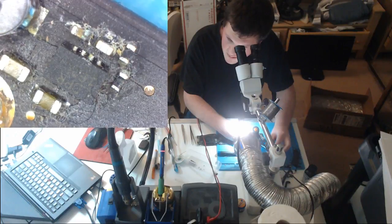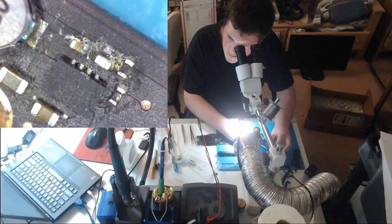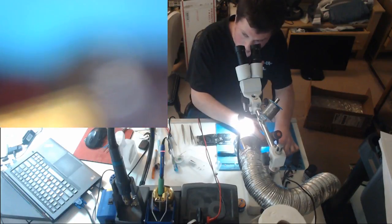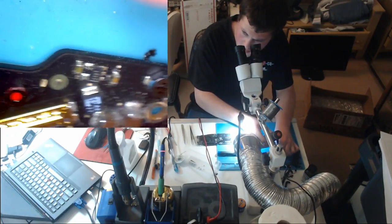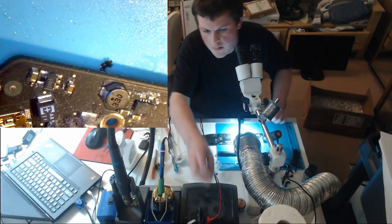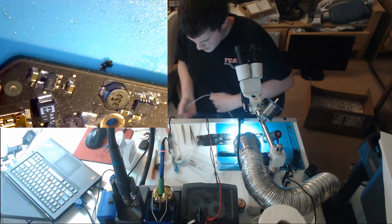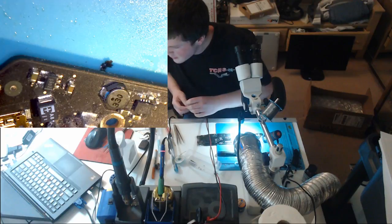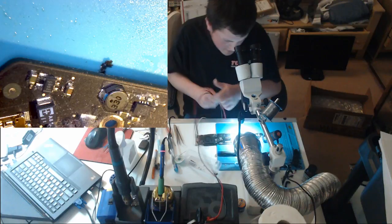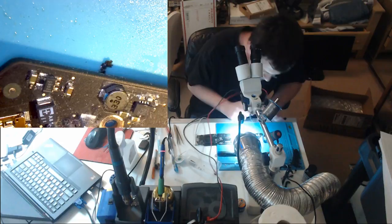Do I even have that chip in? I don't think I even have that chip. But let's measure what PP3V42 is. Mode. Get our charger. And let's measure. One on ground, one right here, and we have 0 volts.